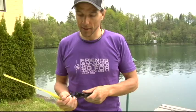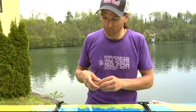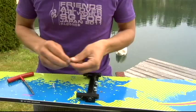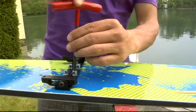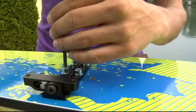So it's going to be this. Just a short check — 54. To mount these brackets we use screws with washers — washers for safety — and screws with a five millimeter Allen key head. We fix them with these screws, taking care to use a good amount of power, but not too much to not destroy the inserts of the board.